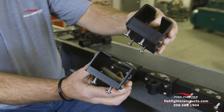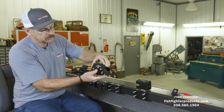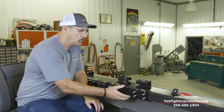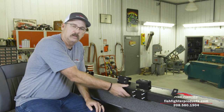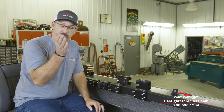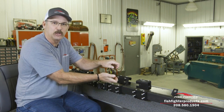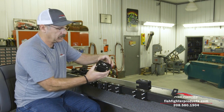If you'll notice what we did, we used a thicker mounting base — this is high-density marine-grade plastic — and we put adjustable slots here on the side plate. There seems to be a misconception within our industry that the slop in these is controlled by the rubber on the gunnel, but that's simply not the case.